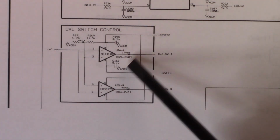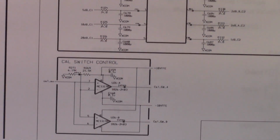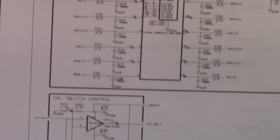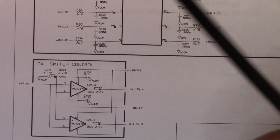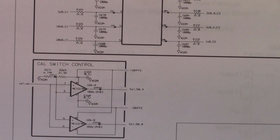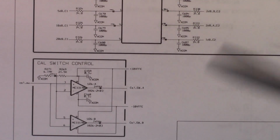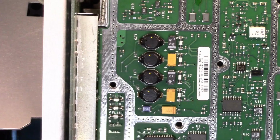So the only thing I can think of is that HP, because they built both the schematic here as well as the integrated circuit, spoke to the designers of it and said, can we save $50 by just using our existing plus or minus 10 rails, rather than putting in another -5 rail on the board, and all the associated layout and cost and so on. And the designers probably said, sure, it'll work. I'm hoping that's what they said.